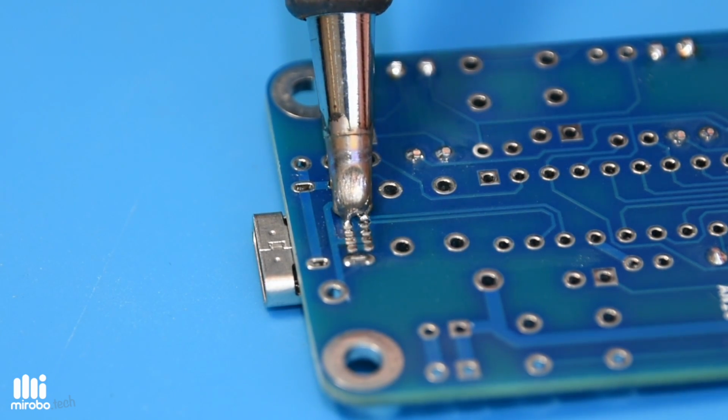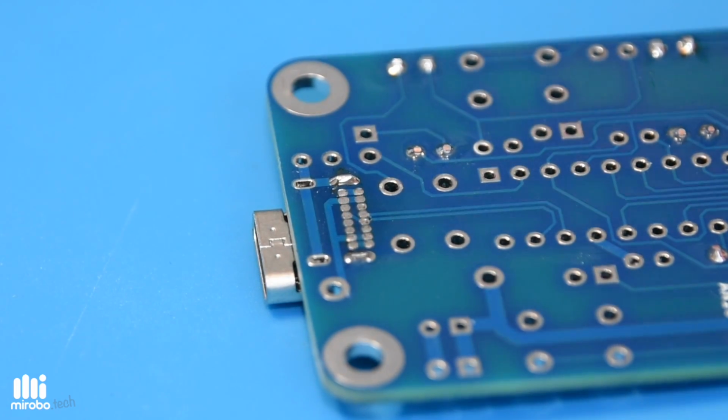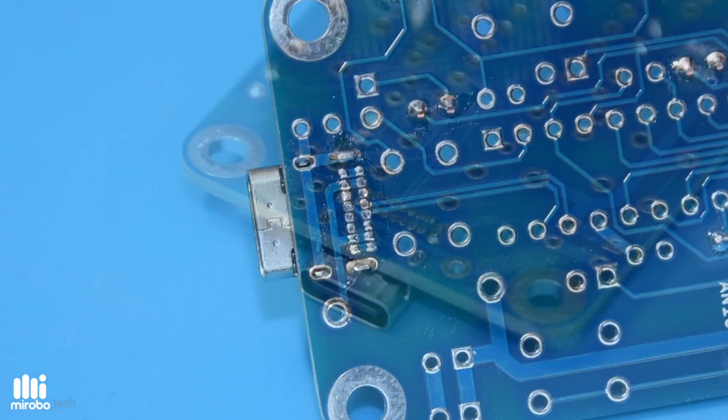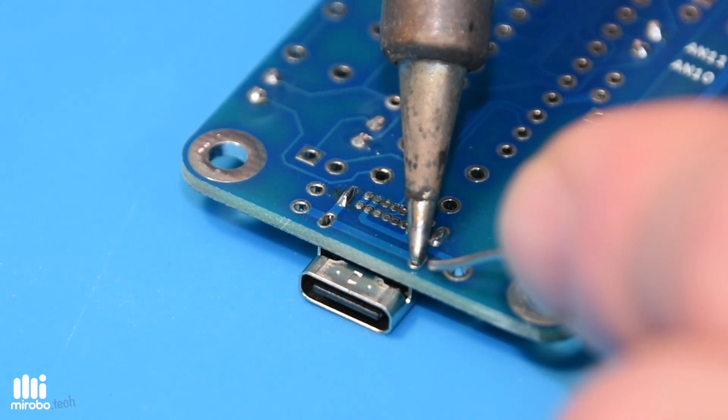If you didn't use enough solder, some of the last pads may not be connected. Simply reapply more flux from your flux pen, load up the soldering iron tip with solder again, and drag it across. When you're done, all of the pads should be soldered without any shorts between them. Finish by soldering the last two USB connector shell pins using your conical iron tip.